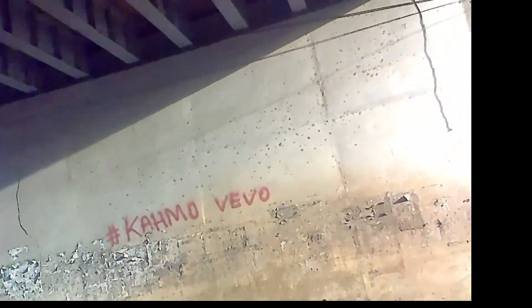I'm not seeing any efflorescence here. If you look at the abutment, it's pretty clean. I'm not seeing any sign of scaling or any kind of spall. A spall is an indentation on the concrete — sometimes it exposes the rebar. There's nothing that tells me this bridge is going to fail anytime soon. The bridge is in good condition, though I don't know what the deck is like because I have to go on top to view it. The wing walls still need a little brushing.